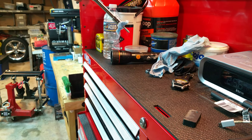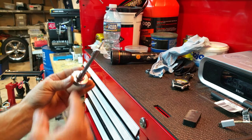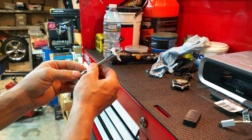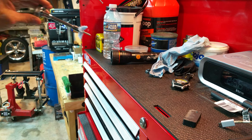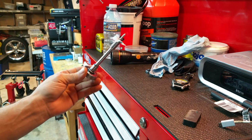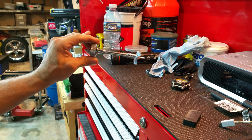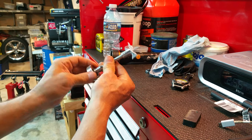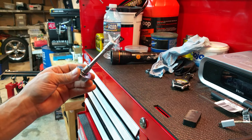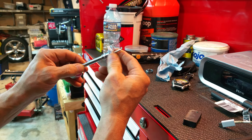It's the paper towel that will hold it in place — it gives it something to wedge into. So you can at least get the thing started, because that's the hardest part: trying to get the screw fed down into a tight space where you can't put your hand on it. This will do the trick. You can stick it down into a crevice or a hole, then go to town turning it. It actually feels magnetized — it's very odd how it works. Just tear a piece of paper towel and put it in between the hardware and the tool.